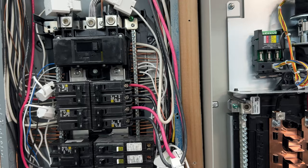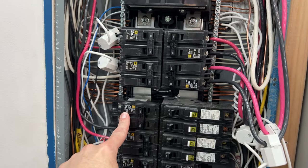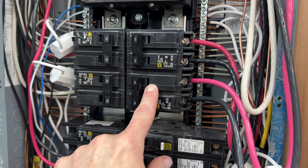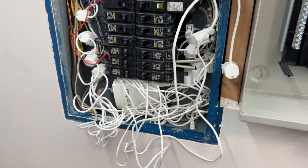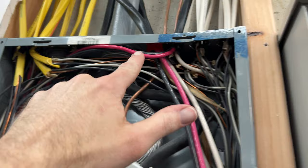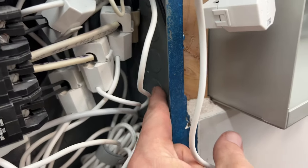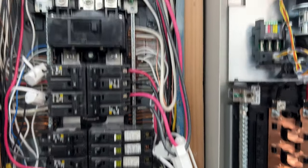The major reason I'm not dealing with this yet is because part of this entire thing — aside from the generator input — is that I will be running this 100-amp up and over into this. And then, because I'm going to want my server rack to have the backup battery power, ultimately this circuit breaker is going to move over there. That's Square D and I'm going to end up rerouting it anyway — why go through the effort of organizing it when I'm just going to change it? That is a project for another day. Mainly because I have to plan out where this is going to go up through — I have to cut the access port for the 100-amp, and then figure out exactly how I'm going to get it through here.